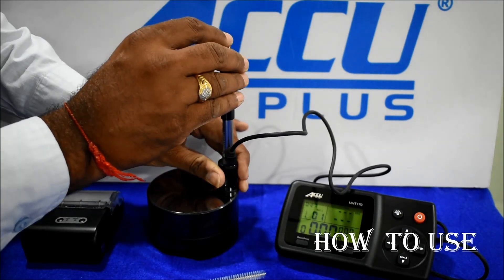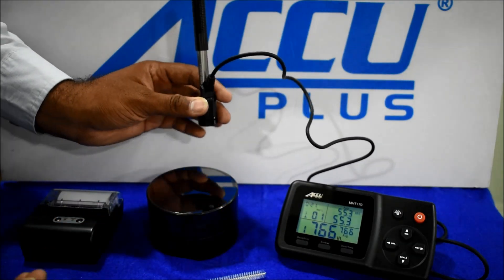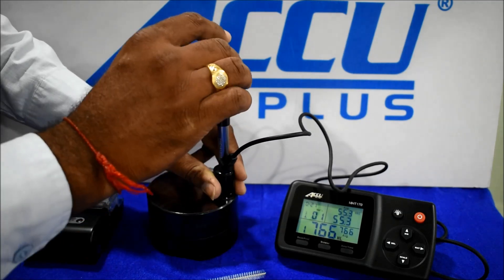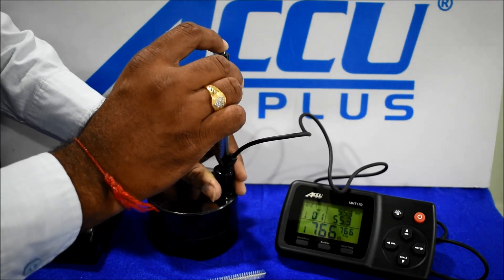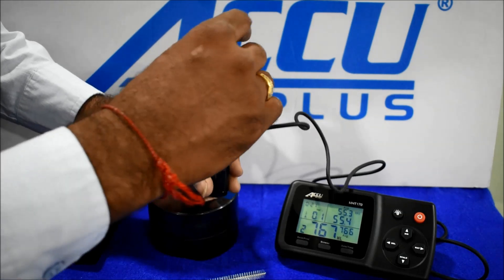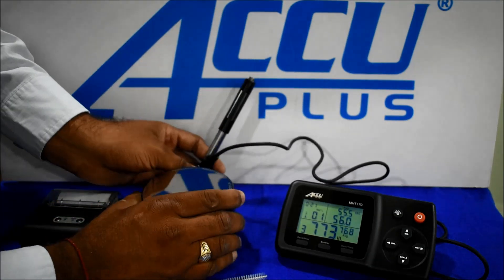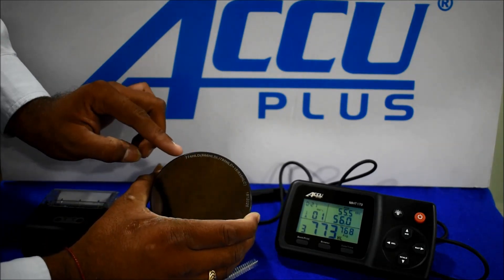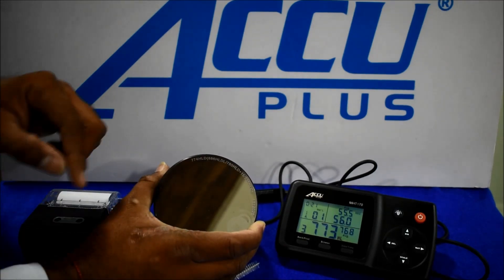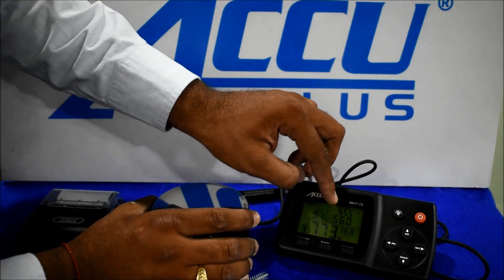We have a block with a reference reading scale. We check on the block and got a reading of 766. Then we take a second reading — push and press — and got 773. The block reference value is 774, and our reading is 773.